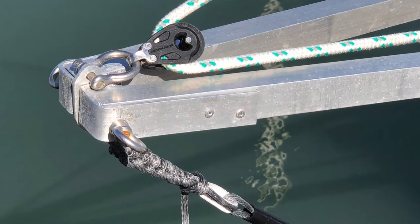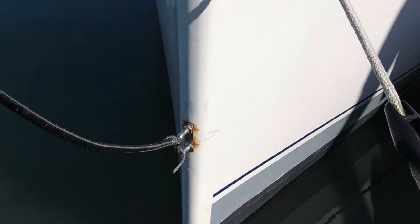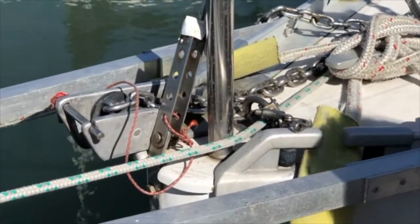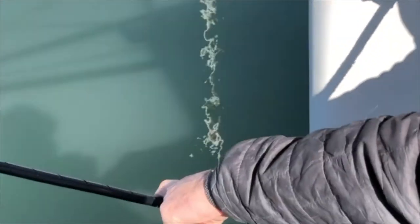This is dyneema and I just lashed that down to the trailer hitch point on the boat. I did add this abrasion resistance on my downhaul for my bowsprit, because when the anchor goes out and the boat sails around on the anchor it could abrade that downhaul, so I think this might protect it a little bit. Also, because I've gone through three versions of a bowsprit now, I added these rings on the end of this through bolt.